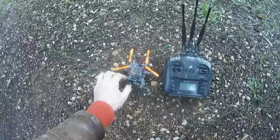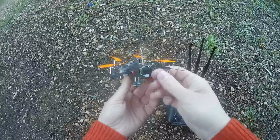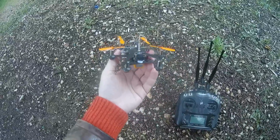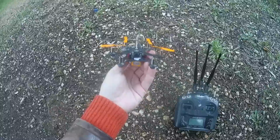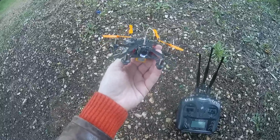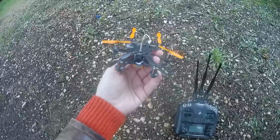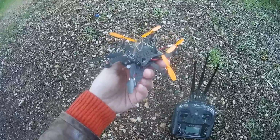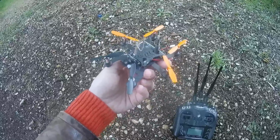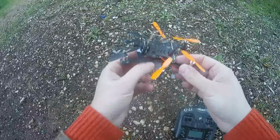Welcome to the first demo flight of the new EX120, our first hexacopter in 2S configuration. First of all, a big warning, as you already saw in the Betaflight configuration: be aware, with the default Cleanflight the flight controller board is wrongly rotated by minus 90 degrees, and the right answer was plus 90 degrees. As you can see, the micro USB port is on the left side.